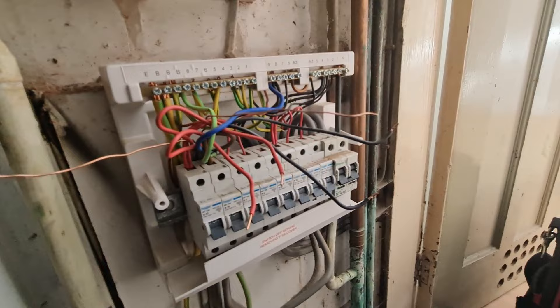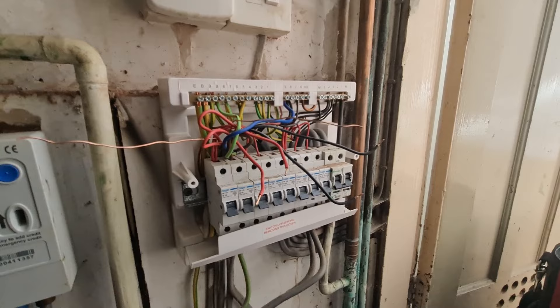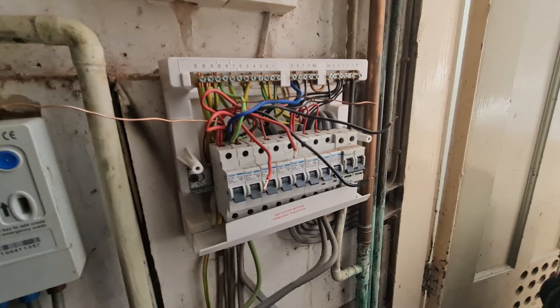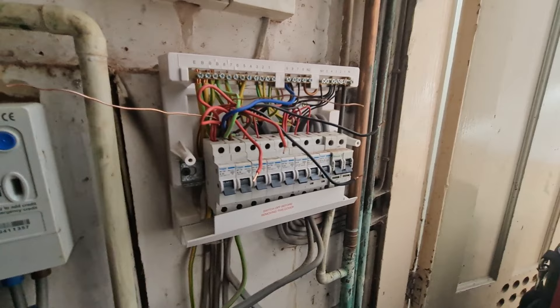You could omit this ring testing entirely on an EICR - you could just take a measurement of ZS if you wished on an inspection. It's not initial verification, so you don't have to run through the same set of tests - it's at the inspector's discretion. People often get upset about that and take things a little bit too far. The possibility of introducing a fault that wasn't there is real. But because I know this hasn't been inspected for decades, because I know somebody has been messing around with it, sticking extra bits in and spares off all over the place, I'm going a little bit more invasive on this than I perhaps normally would.